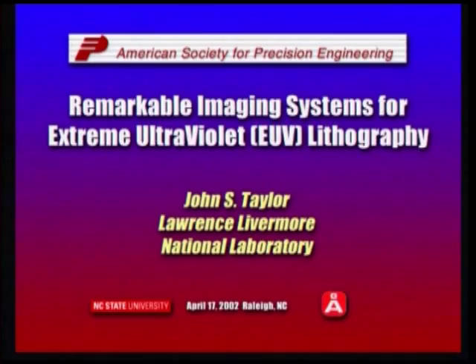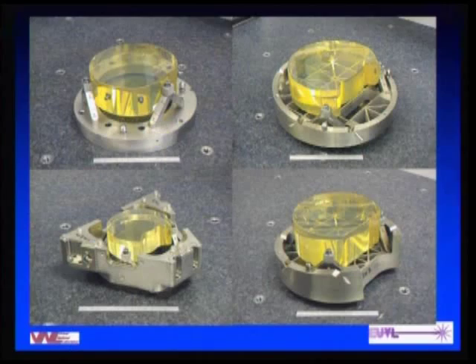Our project started about five years ago when a group of semiconductor IC manufacturers approached us and gave us a challenge: to build a full-size, full-scale EUV lithographic exposure tool. The historical perspective at the time was that many people were worried about the end of lithography based on excimer lasers, so there were a number of technologies being proposed as the NGLs — the next generation lithographies — including ion beam projection, e-beam projection, direct write e-beam, and proximity x-ray. All of those technologies had their technical champions, and the chip companies came to the national labs and asked us to become the EUV technology champion.